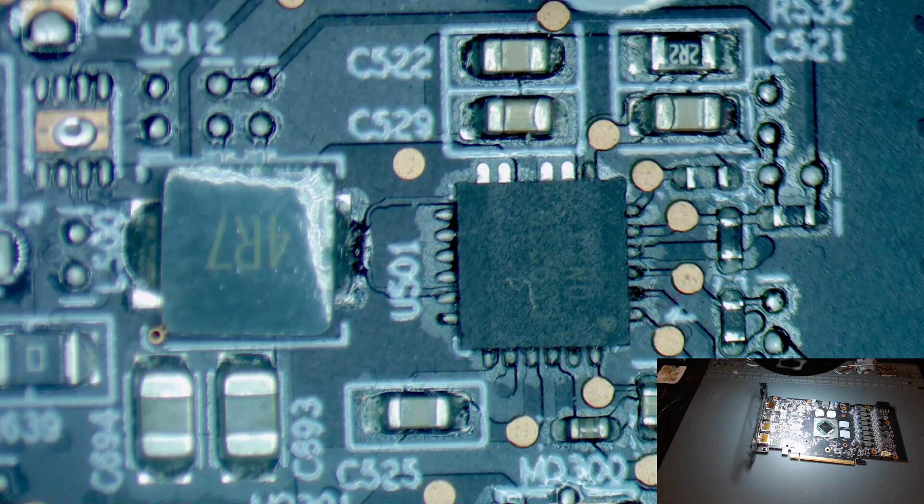I've pulled up a pinout of the chip. The datasheet isn't available, but the pinout will do for now. The things we want to check: enable is pin 2, feedback is pin 5, AN is most likely pin 7, VIN is pins 8 and 9, and LX is the output which we already checked at 300 millivolts. We'll also want to check BOOT, VCC, and VIN — I'll skip BOOT for now but we'll check VCC and VIN. So we want pins 2, 5, 7, 8, 9, 21, and 22.